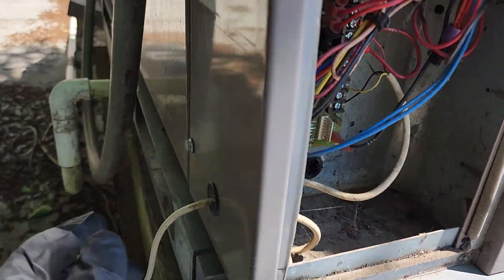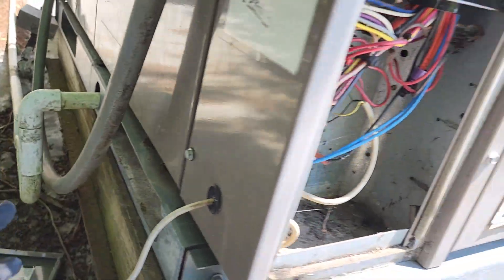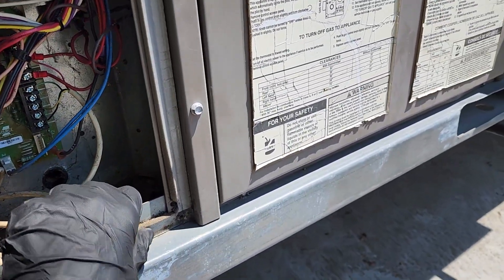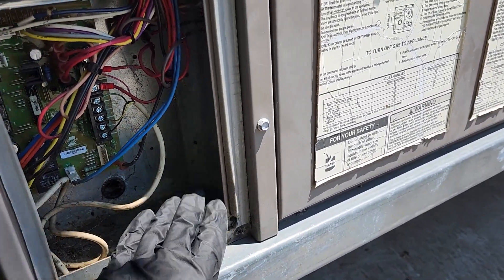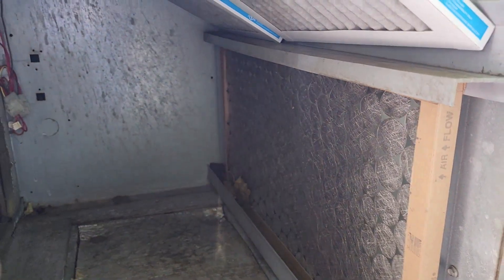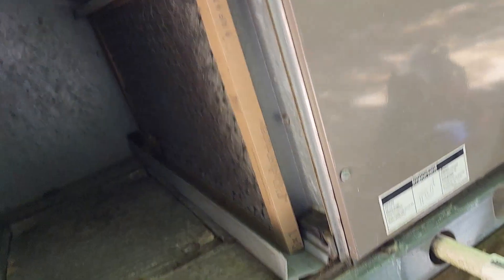They said they felt no fan running. I'm gonna see maybe if the belt snapped, but I did have pressure here, so the fan's definitely blowing. I'll still take a look at the fan compartment. Taking a look at the filters — not clean, but not awful. I'm gonna see what's up with the pressures now.